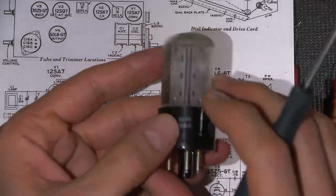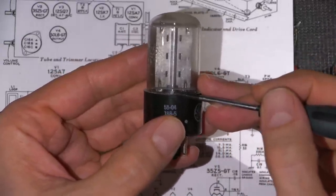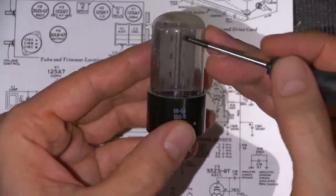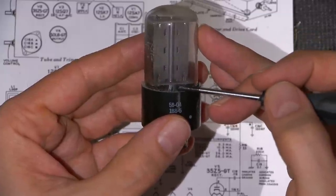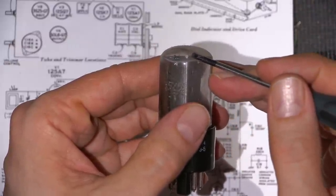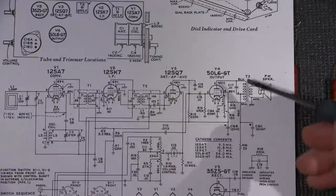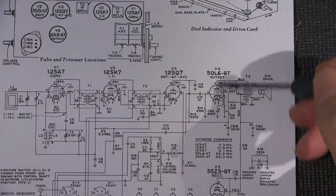and we can see the pipe inside this rectifier tube. You can see the filament strands down in the bottom, and then there's the pipe, and those filament strands go up and down inside of that pipe right in the center. It's not touching the plate here, but it's spaced away from the plate. You can just see the top portion of the pipe poking out right there, and then the filaments coming out of the top. That's the cathode sleeve. That's this thing right here. That's what's supposed to glow, all right? That glows and that emits electrons.